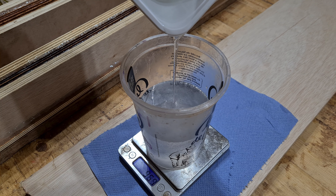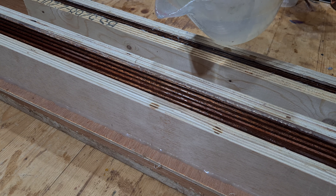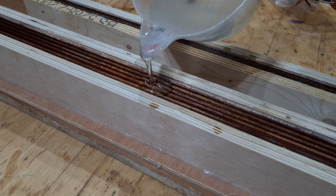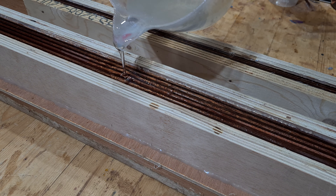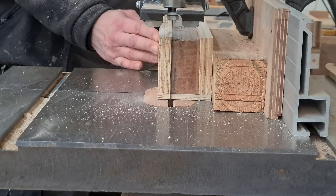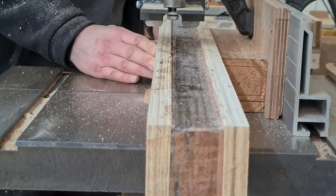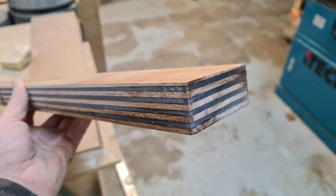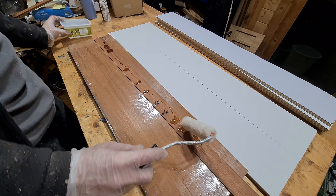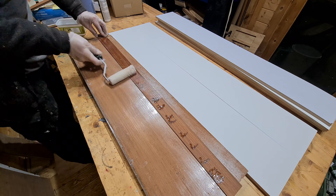The ends were then sealed with hot glue, and so too was the base of the mold. Once the system was dried into place I removed all the spacers — the walls seemed fairly straight, although there was a little more deviation on the two millimeter walls. Once all was set I could pour an epoxy resin, and this led to a bit of a mistake. Not only had I forgotten to use packing tape on the walls of the mold, I also used a thin pour epoxy resin. Given that this was the first attempt it became a concept showing the alternating wood and resin layers, so in the final instance we should have a transparent plywood, at least in two dimensions.